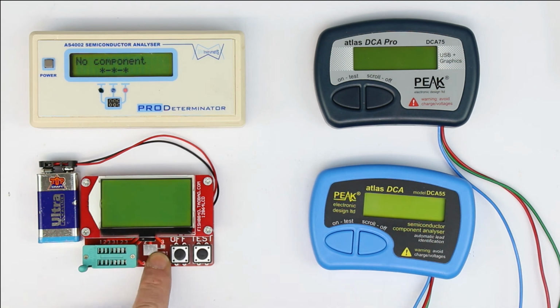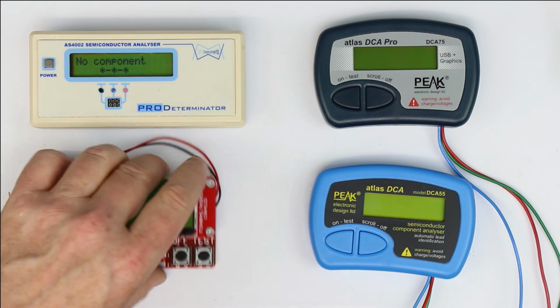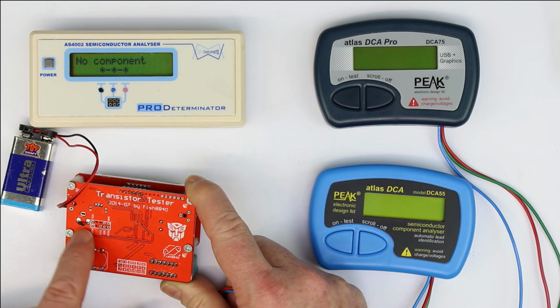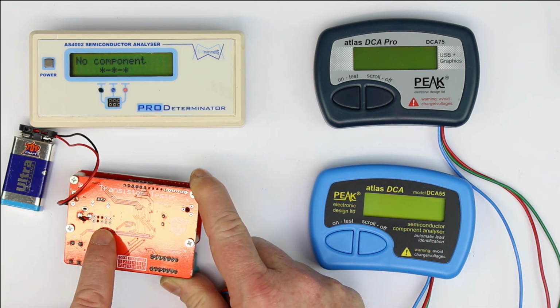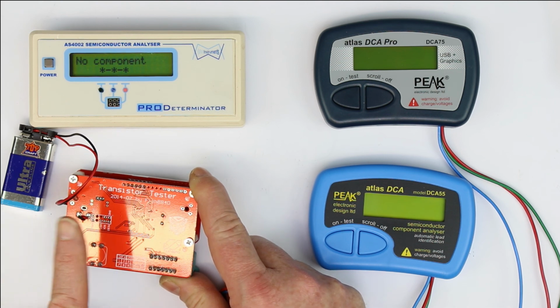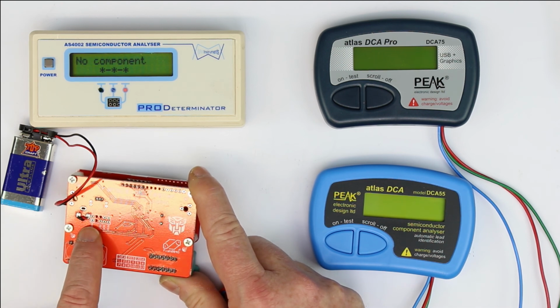While this one here, that's quite interesting. It has an ATmega328P inside, and you will know this is the controller that is also used in the Arduino. And on the back side, you can even see the standard 10-pin header for ISP programming, so you can flash the firmware if there are any advanced or later firmwares with improvements. You can flash the firmware on your own.